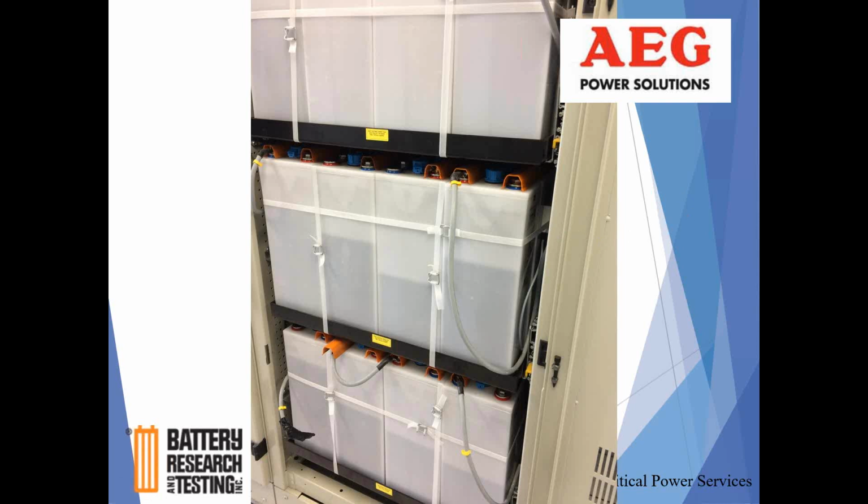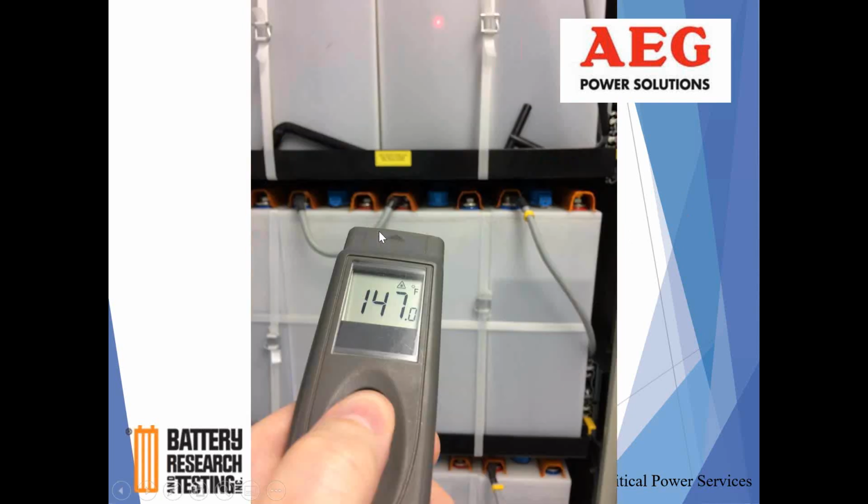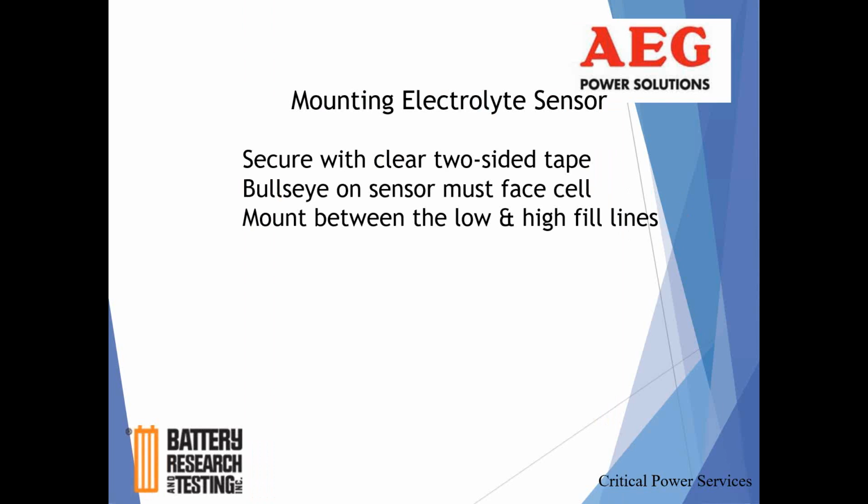We strongly recommend installing those sensors. For one reason, it'll help you get away from situations like this, where the electrolyte level got to the point that the battery heated up to a temperature of almost 150 degrees, and actually ruined the batteries.